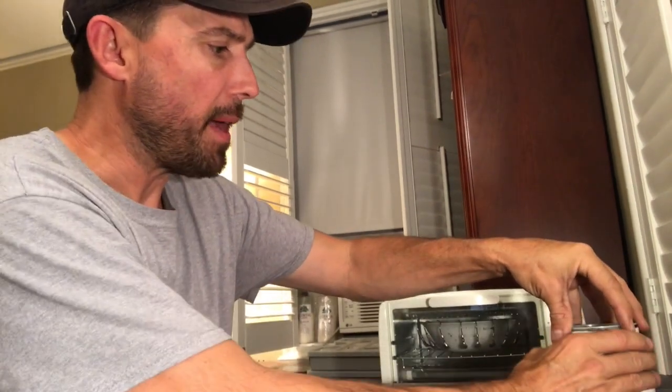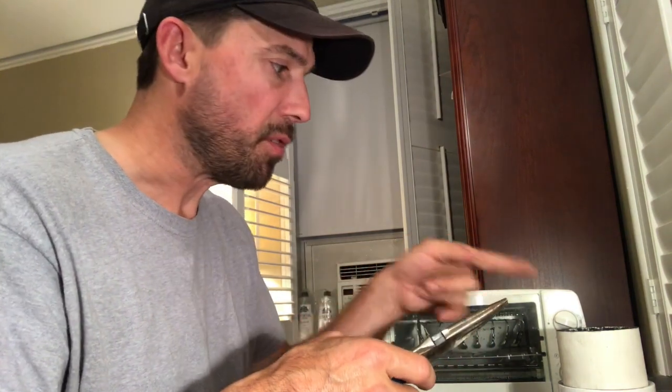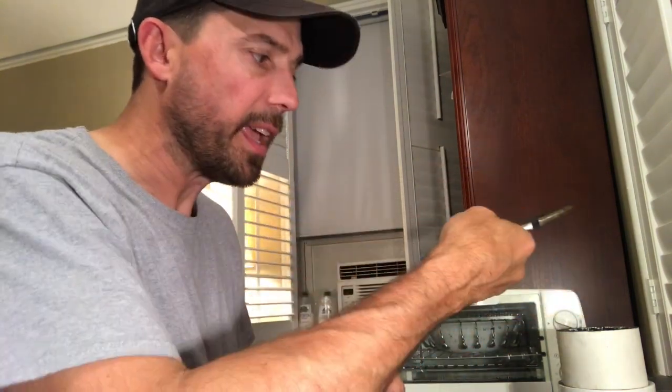Okay, so we're about ready to paint, and what I do is I'm just gonna pop the lid off of the powder paint here, and it is still just boiling away for me. You can always adjust it a little bit if you need to. So I'm gonna dip a couple in here now, and then I'm gonna move the camera so you can actually see me dip the jig head into the fluid bed and how that works.